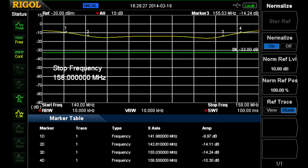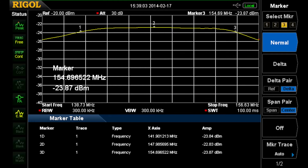That same antenna with the broadband balun, measured through the cable to the broadband balun, shows more like what I'd expect — because the antenna should be around 75 ohms, which would put it at 1.5:1 SWR over that range. That's what we're seeing in this sweep through 50 feet of coax. The gain of that antenna from 141 to 154 MHz shows it's fairly broadband. The 1 dB down points are at 141–142 MHz and 154.6 MHz, but that's only a half dB down per antenna.